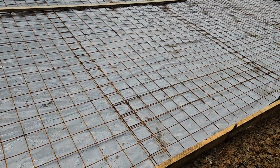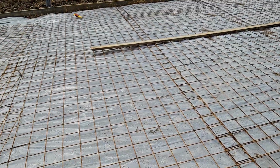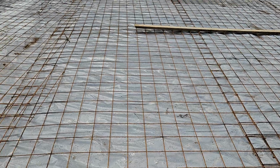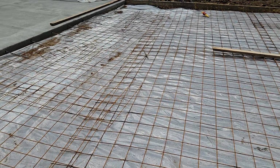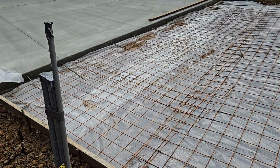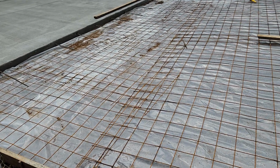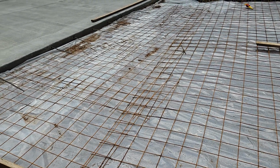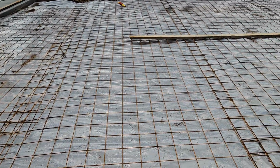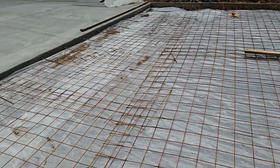And then also what you see underneath here is literally plastic underneath the concrete. What that's doing is allowing it to not get as much freezing and thawing pushing up, because moisture could get up underneath our ground and, when freezing, heave our driveways up and push them up. But right here, this is stopping this from happening as much. No, it still can naturally, but not as much. Really helps out. Also, this is really wet ground, so they're not laying it right on wet ground. It's giving them a little better surface to pour concrete.